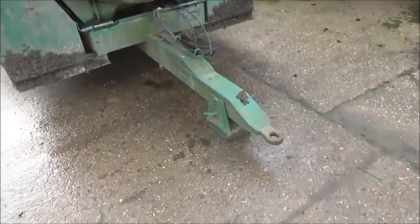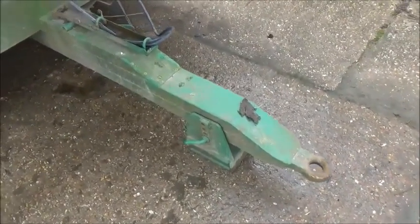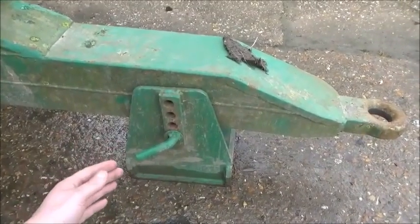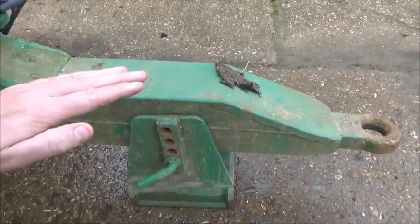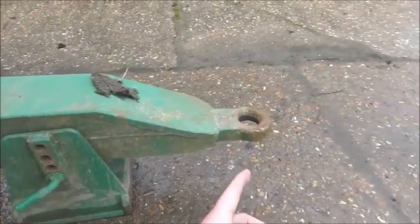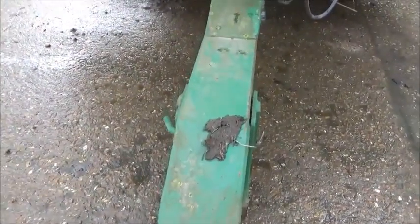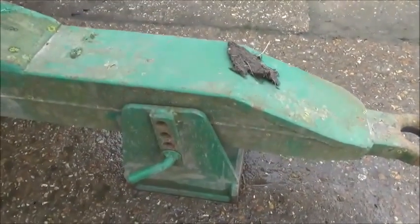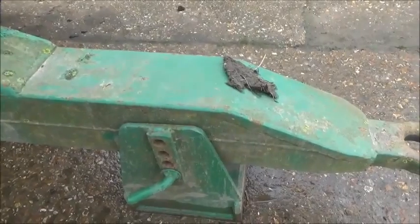Here's a bowser, just so you can see — the actual lowering and raising is done with the tractor. With that pickup hitch we don't tend to have a jack leg on the side that you wind up or down; we have a foot or a shoe that's just lowered straight onto the ground. Anything can hook up to it — it doesn't have to be a specific height because the hitch will come in from underneath and the whole thing is lifted up and clicks into place. If you're on rough or wet ground where it could dig in, once it's up take this pin out and you can hang it up on a bracket on the trailer.